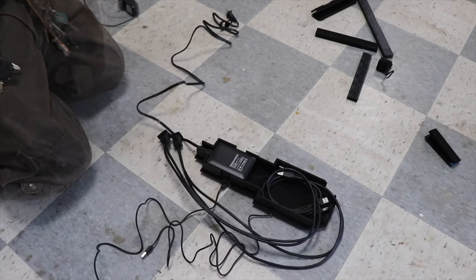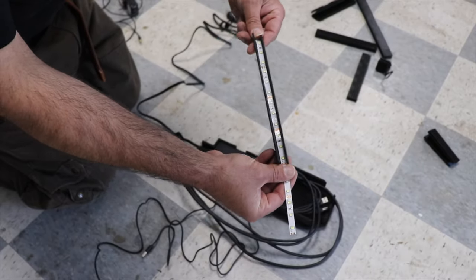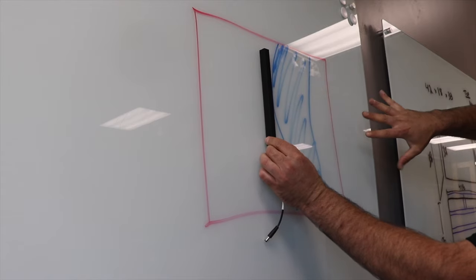Because we did not want to embed the LEDs into the resin pour, in case we ever don't want them or in case they ever break, we 3D modeled a basic pocket that will hold the LED strip sideways. We can cut these and mess around with their orientation to best fit the curve of each resin river for even lighting.